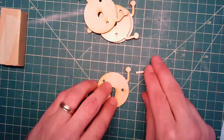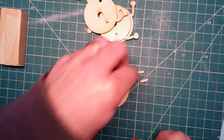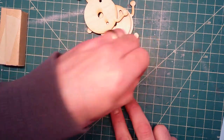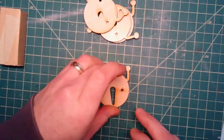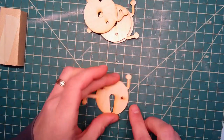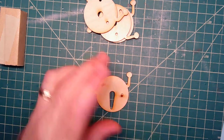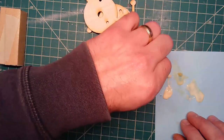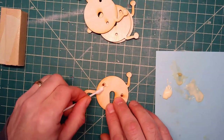You're going to need two half-inch dowels. Go ahead and put those dowels in the first one. Make sure that they go through all the way to the bottom — they should be flush. And just like in previous videos, we're just going to put a little bit of glue right around the dowel area.